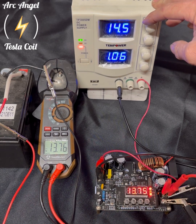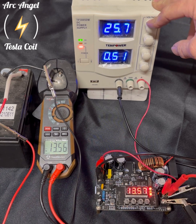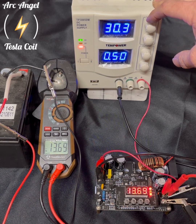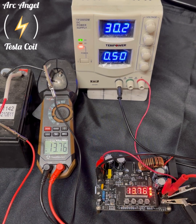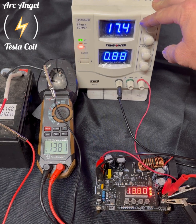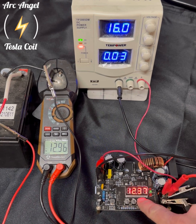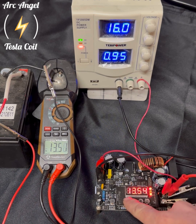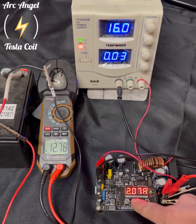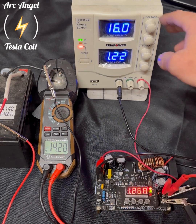Here I'll show you with the voltage fluctuating how low it can go and then how when you go to a higher voltage it stays consistent. These really come in handy when you're trying to use hoverboard wheels as a generator, because the voltage is always fluctuating depending on how fast you spin it. The type of buck you use depends on the speed of the hoverboard wheels, since speed is in direct relationship with the voltage and the current. In part two of this video I'm going to be showing a hoverboard generating power running through a buck and running a battery or powering something directly off the buck.